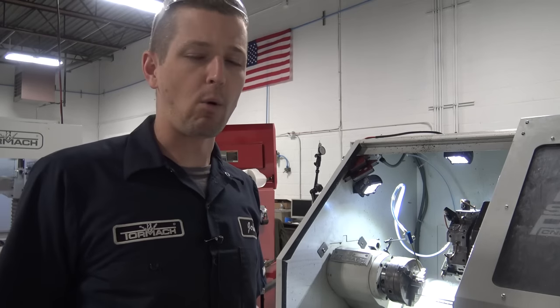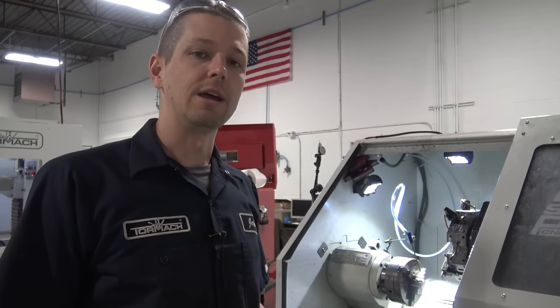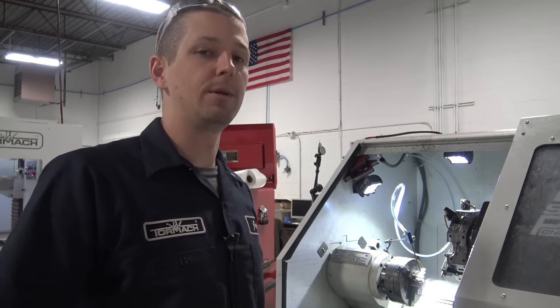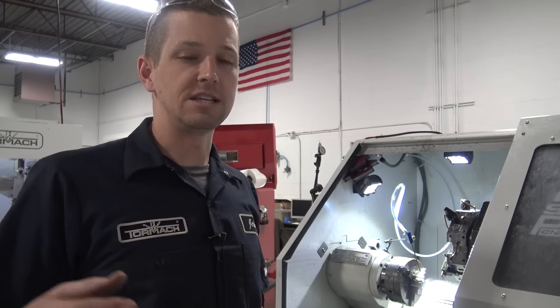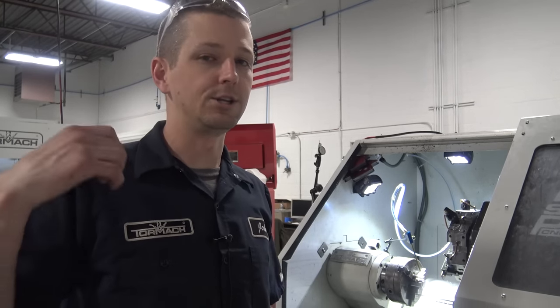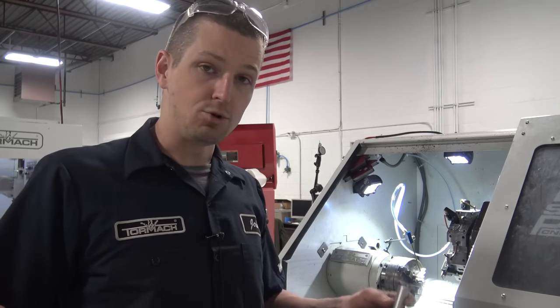There's just something beautiful about watching threads get cut in the lathe, but I'm getting more control from a CAM standpoint from thread milling it, which is really important when it comes to this lead out. And it's easier for me to visualize in the simulation. We'll talk more about that in the Fusion Friday, but you could do it either way.